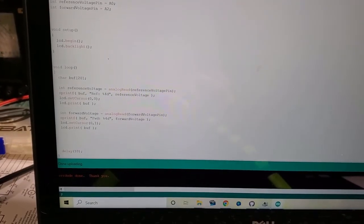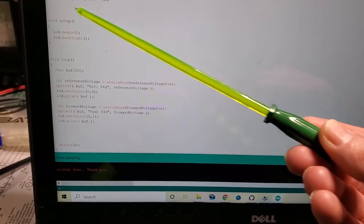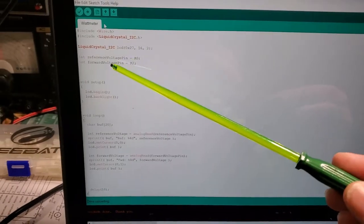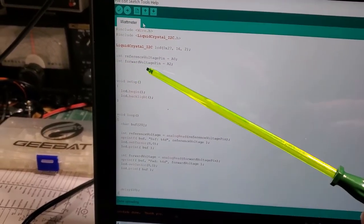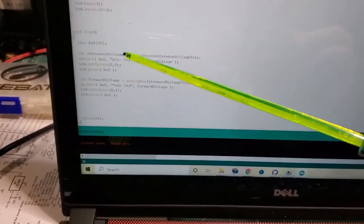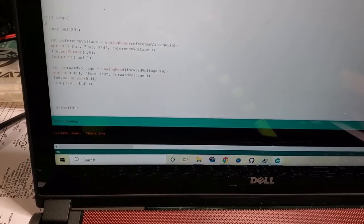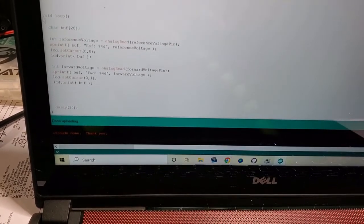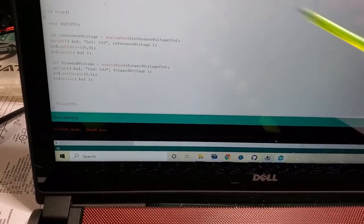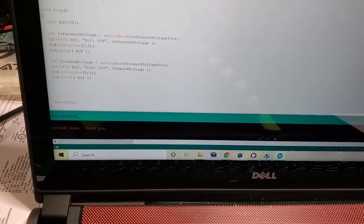Just before moving on to putting this on a board, just walking through the code, it's really simple. I've just added this new voltage pin here. So sorry, let me pan up to that. I've added the new A2 as the analog to digital pin I'm using for the forward voltage. And then you can see down here, I've just got some additional code to read and print the value on that pin. So very, very simple stuff. Obviously, once I get it onto the board, I can make the code a little bit more sophisticated, perhaps include some calibration and so on and so forth. But anyway, I'll move on to the next video now.